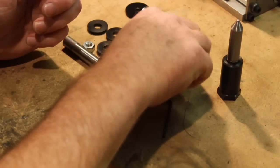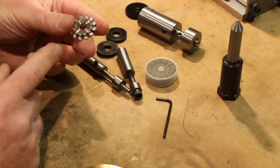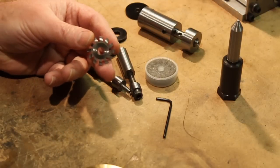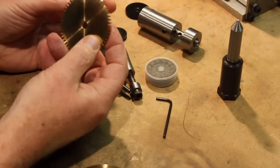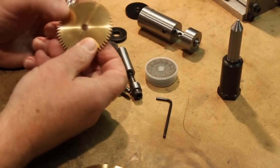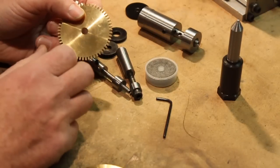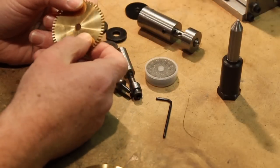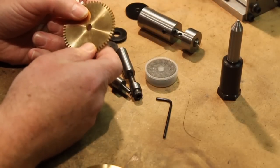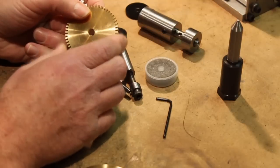The next thing is the actual holder for the gear cutter itself. This is an epicycloidal gear cutter — the kind of teeth used in watches and so forth. They have much less friction than standard involute gears, and if you're building a mechanism that is turned by hand, with a crank, or even driven by a pendulum, you need that very low friction. These teeth are also not designed for high force — involute gears can handle much greater strain when you're driving them by RPM with a motor.